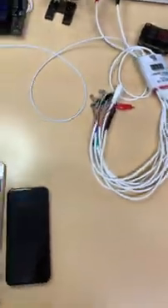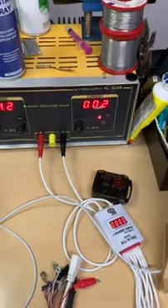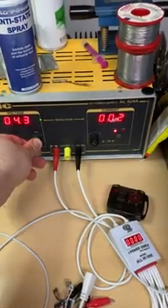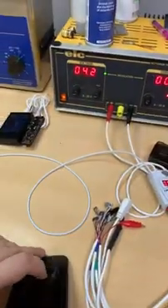Unfortunately, to replace the Wi-Fi chip you need to unlock it, reprogram it, and have a special type of programmer — it's a time-consuming, long repair. Whereas the U2 IC is a very straightforward Tri-Star IC resoldering under the microscope, takes about 15 minutes including disassembly and reassembly.